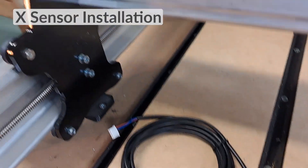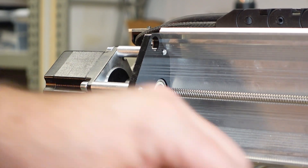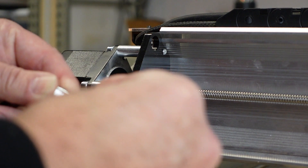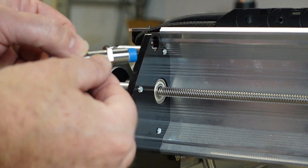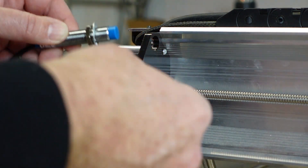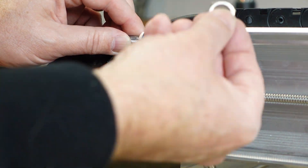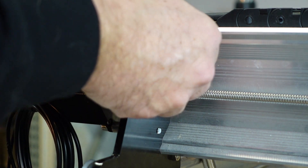Here are the parts for the X-sensor. Notice that we're short a washer — it's because there's a bit of an interference fit and it won't fit against the rail, so we'll just leave it out for this installation. Same as before, you'll thread a nut and washer on the sensor before installing it into the gantry plate. If you have your controller and motor on the right side, install the sensor in the right gantry. Thread the remaining nut onto the sensor, just finger tight — we'll make adjustments shortly.